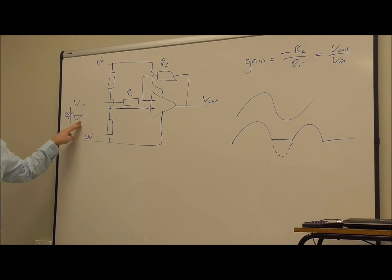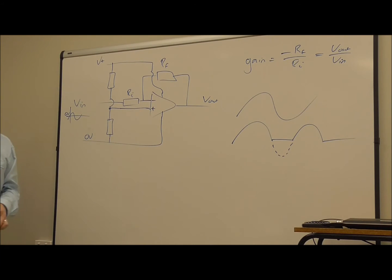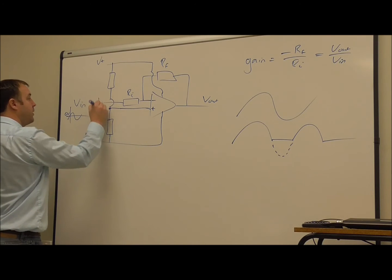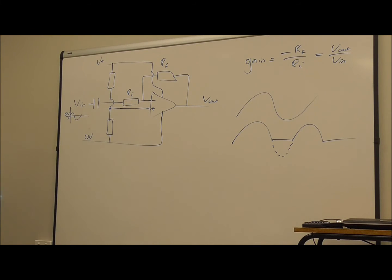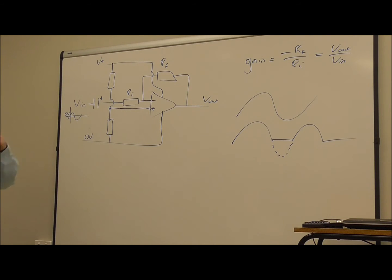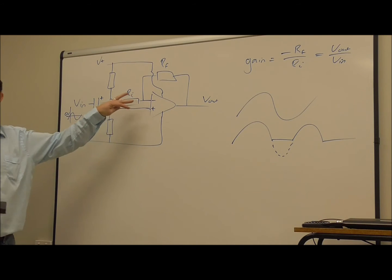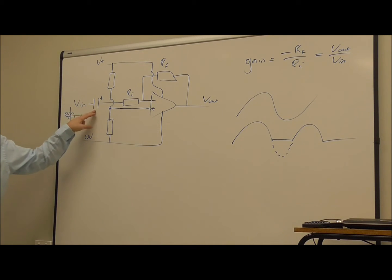So what we can do is use something called a coupling capacitor - just a capacitor to connect the input voltage to our biased amplifier's input voltage. These are usually electrolytics and usually a reasonable value, so a few microfarads for this input. This input doesn't really matter too much because it's generally got a high input impedance, so we're not going to get much current from the input source, which means the capacitor's voltage won't change very much.